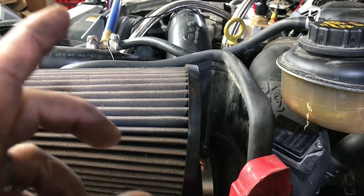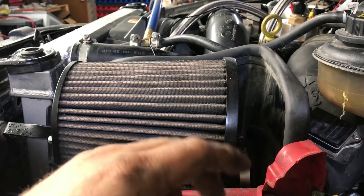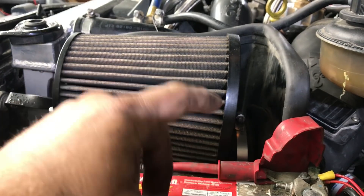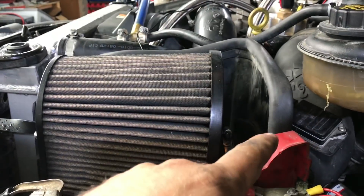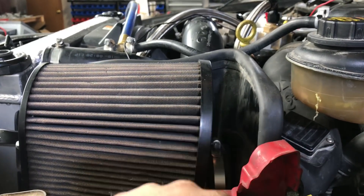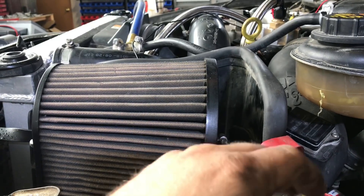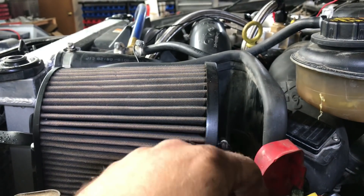The main thing we're going to focus on right now is the heads. When we're running the truck, it starts up and runs fine until it gets warm. What starts to happen is the driver side head is actually bad. When I tear more into this and get the heads off, I can show you on a machine what we're looking at. When I do a compensation test on the FICM system and have the injectors stop compensating and just add an equal fuel amount to every piston, the whole driver side wants to drop out. I'll show you what it looks like on the computer.